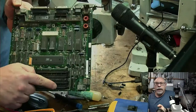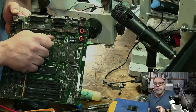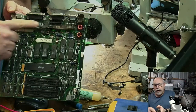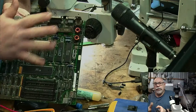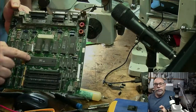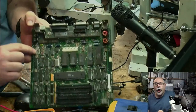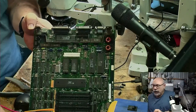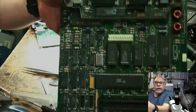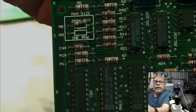And this is a Mac Plus board here, and that's obviously where the RAM goes. When you pull the computer apart, you've got to very, very carefully unplug this cable here, and unplug the floppy drive cable here, and then once that's unplugged, the board just slides out. That's the CPU there. Now here, the resistors you need to cut. So this has already been cut.